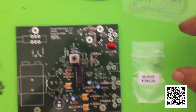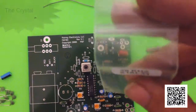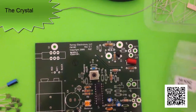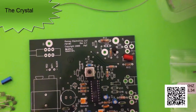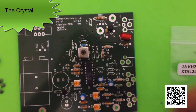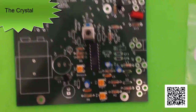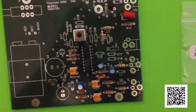Now we're up to the stereo generator part of the circuit, which involves this tiny little crystal — probably the smallest part in the whole bin. They recommend saving some component leads from earlier installations, because you need to solder the crystal into its two holes and then use one of those leads to hold it down flat on the board. Two capacitors, C11 and C12, go along with this section to complete the stereo generator.